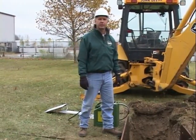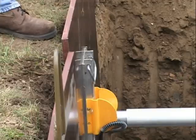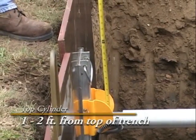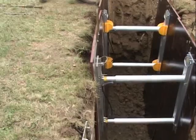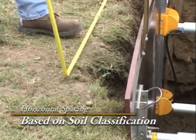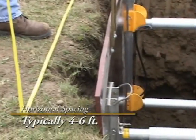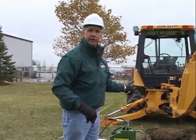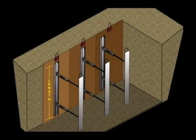Every job should have a competent person assigned to the project. One of the jobs of the competent person is to make sure that the shoring is properly installed. A good rule of thumb: the top cylinder should be somewhere between one to two feet from the top of the trench, and the bottom cylinder should be no farther than four feet from the bottom of the trench. Once the soil is classified, you also need to determine how far horizontally the shores need to be installed apart — in most cases somewhere between four to six feet. Please refer to the tabulated data. The tabulated data chart will also help you determine the necessary length of the shore's rails and the number, width, and proper placement of cylinders required for your project.